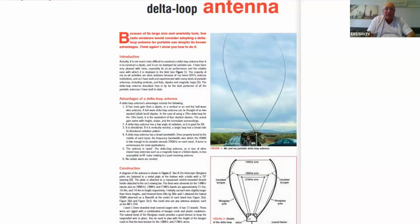No, I fully understand what Hiroki's saying, and yeah, if you can build one, all closed loops are so quiet. Back home, my noise level is not even moving the S meter, and at the very most, it's S1. And you can hear stations that you can't hear on vertical antennas, and sometimes other sort of mini beams. If you put up something like this, you're spoiled, because you'll never go back to other basic Yagi type beams.